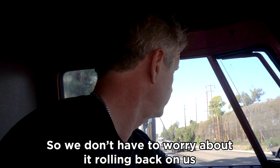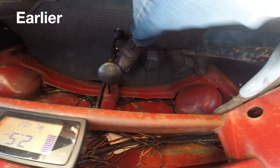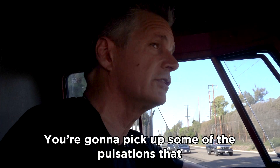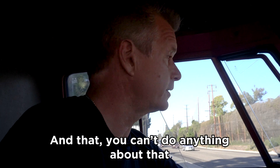The ultimate solution is to have creep mode set up, so we're not going to worry about rolling backwards. I noticed some vibration and a little bit of shuddering — that's just the low-speed behavior of this motor. It's a lower power motor, so at low motor speed you pick up some pulsations in a sort of one-to-one setup. You can barely feel it, but you can't do much about that.